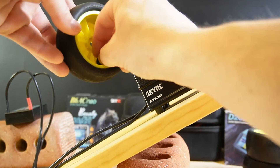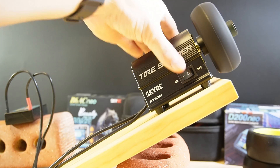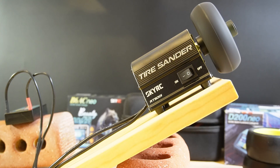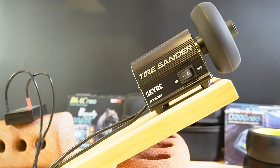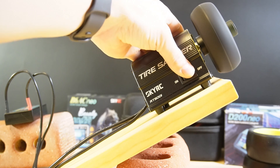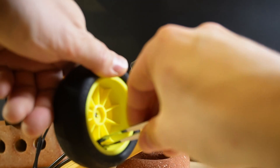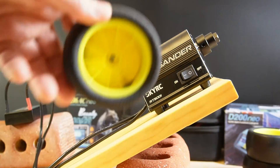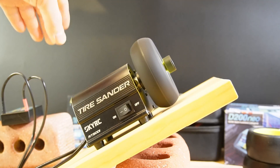For comparison, I added the clay back to balance the wheel and gave it another go. This time, with the wheel balanced, there were hardly any vibrations, so the sander didn't move. I think this perfectly demonstrated how a balanced wheel helps maintain traction. I just wanted to see it slide again, so I took the clay off to unbalance the wheel — and sure enough, the sander slid down the slope once more.